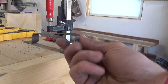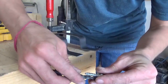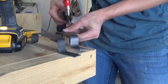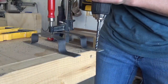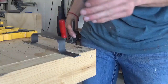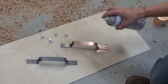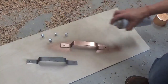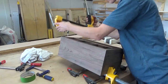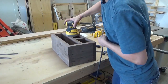To attach these handles, I was using 1.25-inch lag screws, so I drilled a hole just big enough for the screw to fit through into each end of each handle. Then I spray painted the handles and the lag screws with a rose gold color spray paint — I thought that would look really good with the walnut. While the paint dried, I removed the caddy from the clamps, gave it a final sanding to remove any extra glue squeeze-out, and applied a simple beeswax finish along the outside and inside of the caddy.